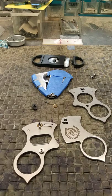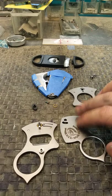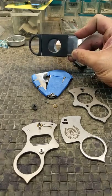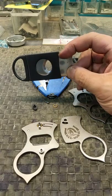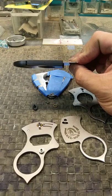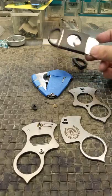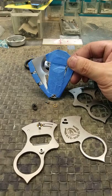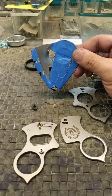The first thing I want to talk about is steel. Obviously, that's the heart and soul of the cutter, and that's going to make all the difference in the world when you're cutting a cigar. On the $5 El Crapo free cutter, this steel is definitely stamped — you can tell it's stamped because there's a rolled edge on one side and a sharp, jagged edge on the other side. It's very thin steel, which makes it easier and cheaper to stamp. This steel, from the manufacturer, they claim is 440C steel — a great steel in 1995, but over the years they've developed better steels.